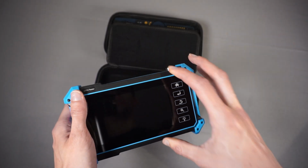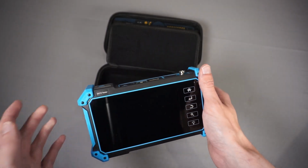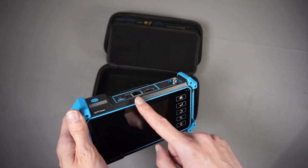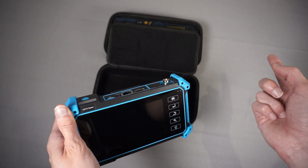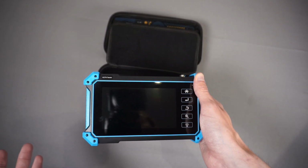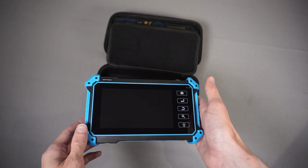It's really neat because it means you can view the video feed and angle the camera, and for things like IP cameras, it's really smart because it can provide PoE to the camera. It can then run a DHCP server to give the camera an IP address. It'll then find the camera on the network and show a video feed from it. So it's definitely really useful if you're doing that sort of work.